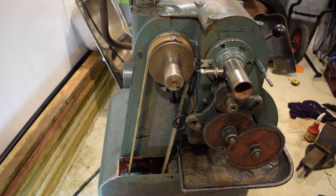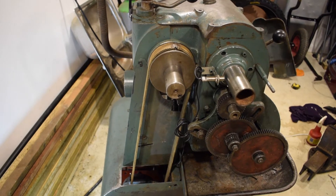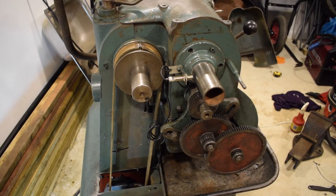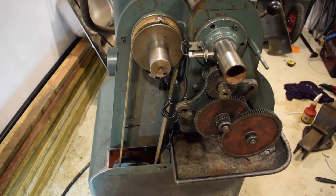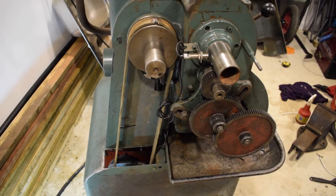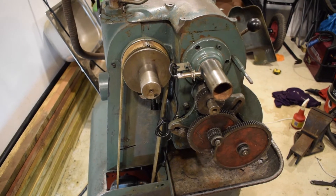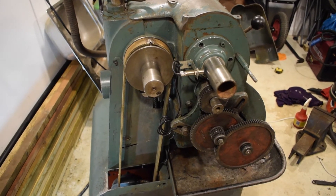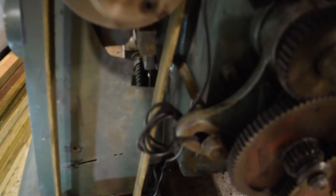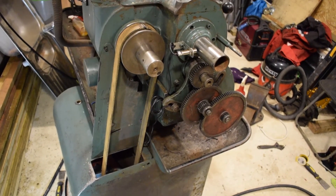So I've got the old belt back on obviously. I'm just waiting for the new one to turn up, but it will be after this video is posted so I'll put that on myself. I put this belt on temporarily. The sensor for the RPM gauge - you can see that little bundle of wire in the middle of the screen there - that is just temporary until I get the new belt. Once I've got the new belt, I'll just make sure it doesn't need any adjusters put on it. Once I have done that, what I'm going to do is tag it to the back of this. I've got some cable ties with little clips that go into holes, so I'll drill a couple of holes down there and mount that.